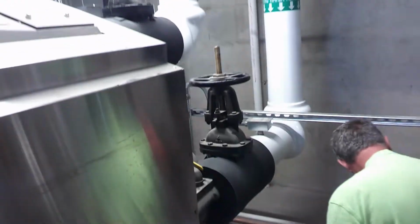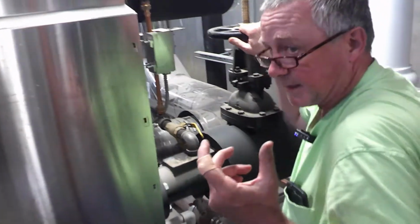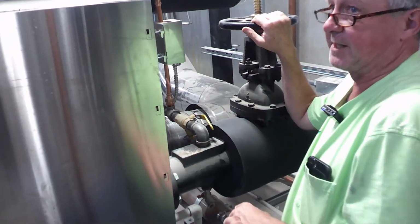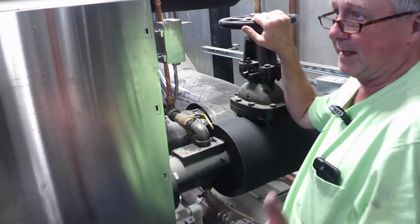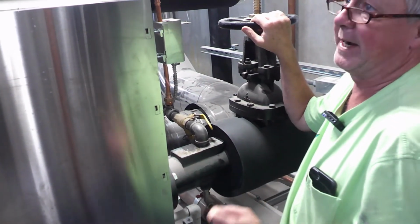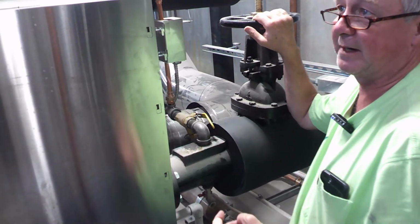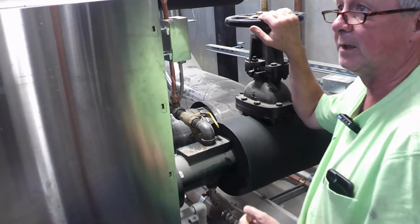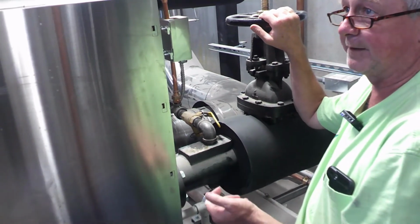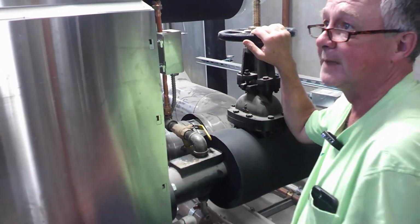Follow this where it goes to drain, and then get this litmus paper, and if the pH is below 5, replace them, because it's no longer filtering the acidic moisture that's coming out of the boiler. And then it's going to eat your drain, and then you got to call an excavation company in to redo your drain, and that becomes very, very, very expensive. So please stay on top of the pH coming out of these. Again, it's very acidic. If you control it through these pellets, you'll be fine.